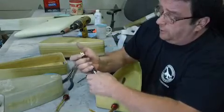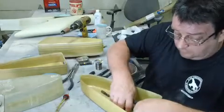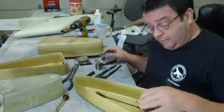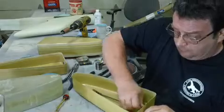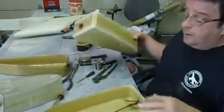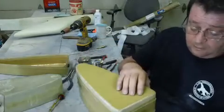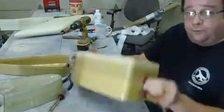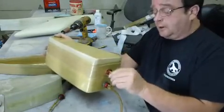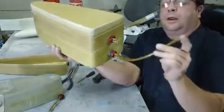Even though you won't be able to get the tanks actually out, you can still get these stoppers out, so you ain't cut off from the world. Okay, now this is my second fuel tank. What's gonna happen is I'm gonna hook these together — the vent goes to the fuel pickup here, and this is the vent on the other, on the main tank, on the second tank, and I'll just plumb them like that. This is my vent, so that'll run to the vent on the outside of the plane, and this one goes to the air trap — and that's how they'll fill.